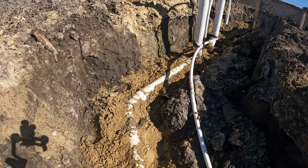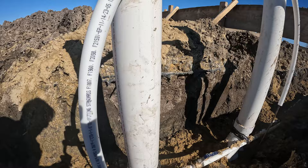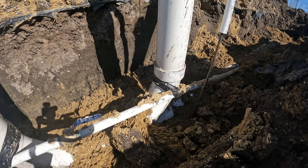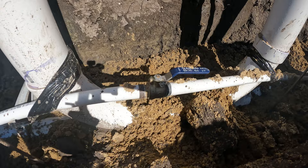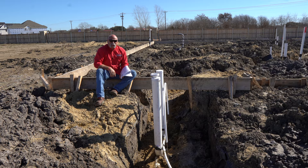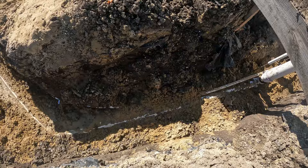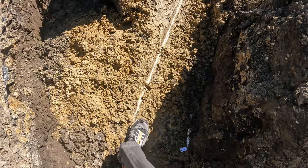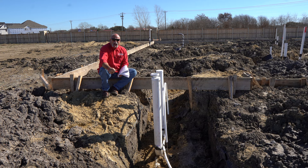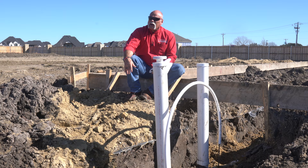It's about three-and-a-half feet deep — perfect depth. I noticed walking over there there's quite a bit of fall in here; I would have possibly brought this up just a little bit, there's a lot of extra digging that isn't necessarily needed. I love the fact they've got the water line run in the ditch — it is benched, so it's not right down next to the drain pipe; it's 12 inches up and 12 inches over. They bring it in with PEX tubing. They do reduce down to three-inch inside, which should handle a house like this, but personally I love four-inch from the furthest toilet all the way back.